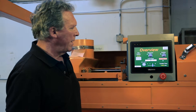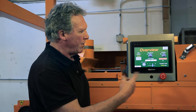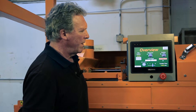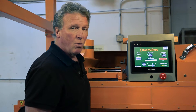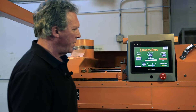Going back to the overview, on this panel you can select how many rows on the individual trays that you want to load. You've got the option of 3, 6, 9, or 12 rows. You can also select the direction you want to feed the machine — from the intermediate table side or from the other side of the machine. It's just a matter of touching the screen in your preferred spot.